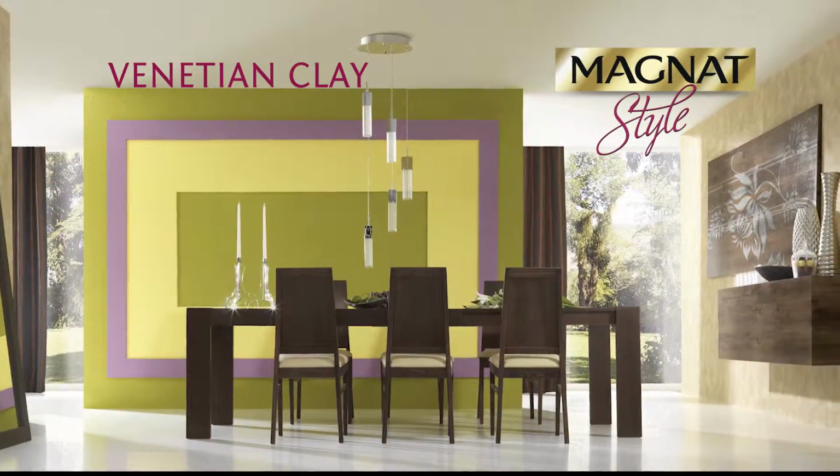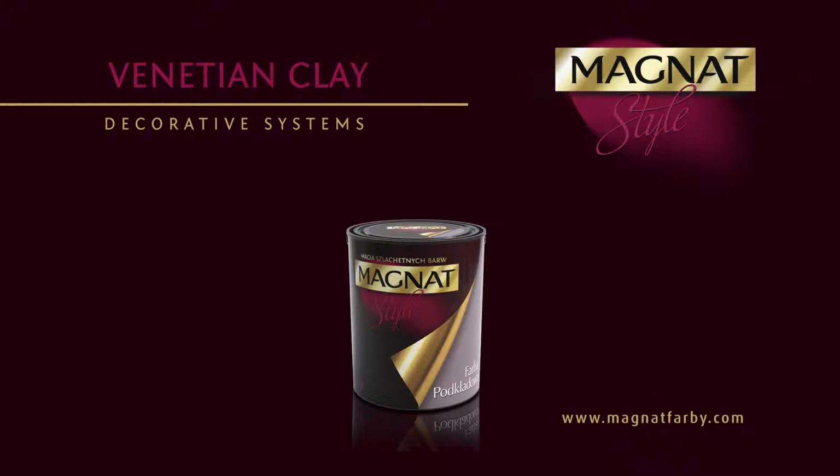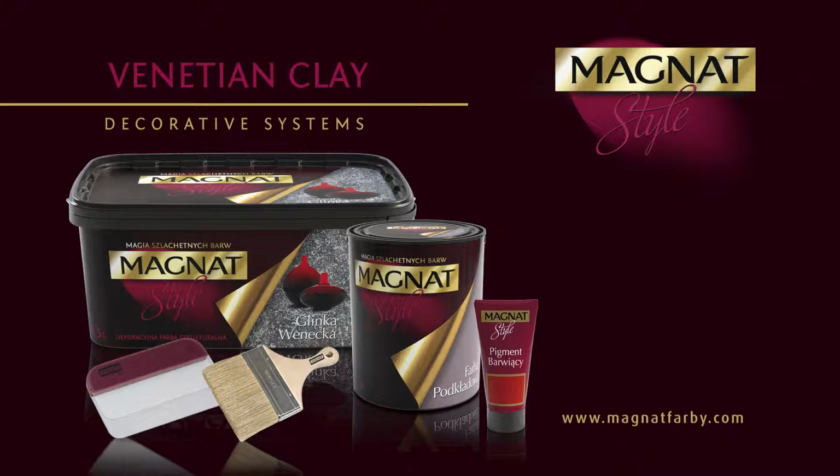Application of the coating requires the following products and tools. Undercoat: an acrylic paint with quartz sand for proper substrate preparation. Venetian clay: a textured paint for the worn plaster effect. Coloring pigment: a concentrated pigment for coloring MAGNAT style products. A Venetian clay brush. A Venetian clay plastic float.